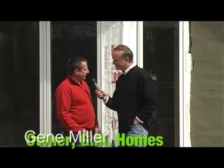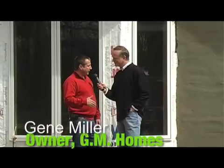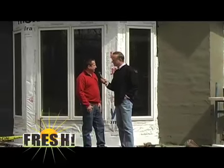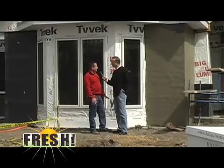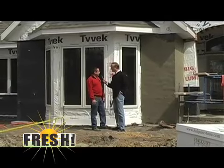So Gene, why don't we get started here, and you tell me that little things can be huge. What do you mean by that exactly? Well, the little details are very important in keeping the water from penetrating the house from wind, snow, rain, all those types of things. Moisture can penetrate the house if it's not flashed properly and built the right way.